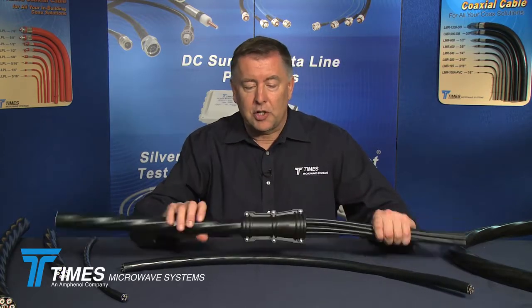You're using fewer clamps, more rugged clamps. In terms of ground kits, you reduce the number of ground kits and improve aesthetics. Aesthetics is a big one. If you're in a public area, maybe a university, a sports stadium or something, landlords are always concerned about aesthetics. This cable here is a 9-conductor LMR 400, very large cable.